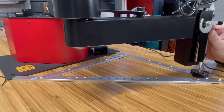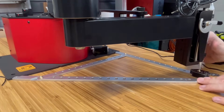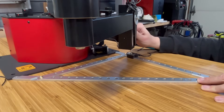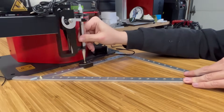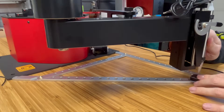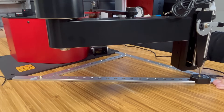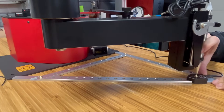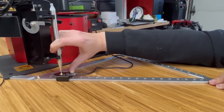We're going to attach our stylus and make sure it's plugged in. We're going to line it up — you can use the jog wheel to move your Z up and down to make sure it's against it. The first step will be to slide it along the axis. Now you may have to hold them both in place — the stylus and that sled — because it may fall off. I found that this needed a little bit of lubrication, very tight. But I was still able to calibrate it. You definitely want to make sure you have it clamped down.